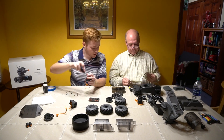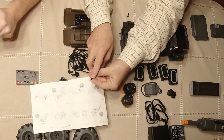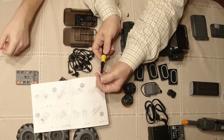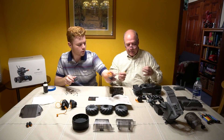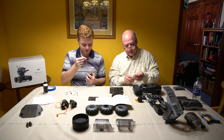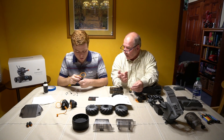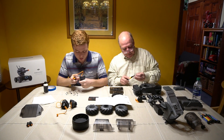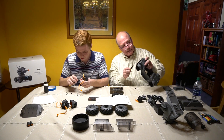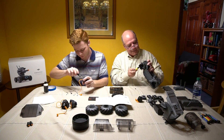I want to point out this screw with the blue coating. That's a specialized material — when you tighten it, the friction turns it into a glue that holds the screw tight. You use that in high vibration areas so the screw won't back itself out. The brand name for that is Loctite. Blue is a light lock, whereas red and yellow are harder locks used in big industrial environments. For this application it's just blue so you can still back the screw out if you need to make adjustments later.